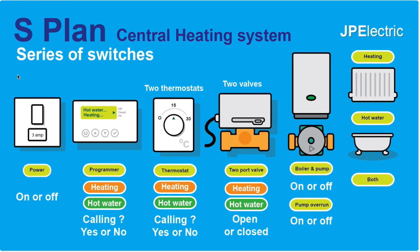Right at the very beginning of the chain we have the power supply, which is generally a fuse spur with a three amp fuse in it. It's only three amps because there are no large loads — we're not using electricity to heat the water, it's only for switching. It's powering the clock, the motor in the valve, the motor in the pump, and various electrical components in the boiler. So we can isolate from here, switch on or off. That's where it starts — it starts with the power.